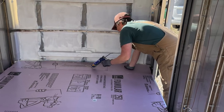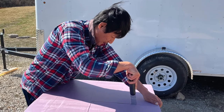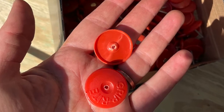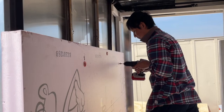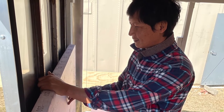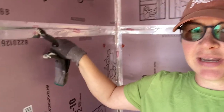Next up is adding two layers of two-inch foam board to start the insulation that will create an entirely boxed insulated room. We're separating the plastic caps from the tiny nails and putting them on large wood-to-metal screws so that they will hold the first layer of styrofoam, attaching it to the metal. With the first layer of foam board attached to the wall, we apply HVAC tape on top of the seams to create an extra added protection barrier and keep it nice and sealed.